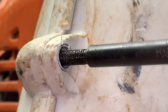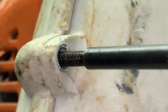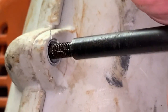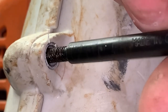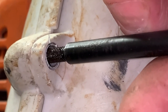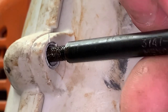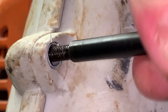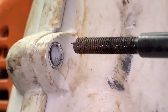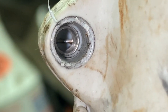Let's go ahead and start installing this Helicoil — I'm going to turn it in until it stops, just going slow, we're not in a hurry. I believe we're there right there, so now the tool should just back on out, leaving the insert behind. Our Helicoil is installed and as you can tell, we now have steel threads in place.